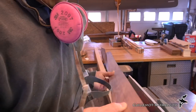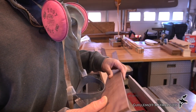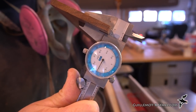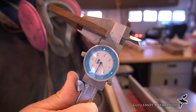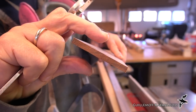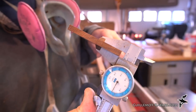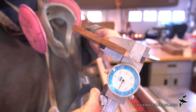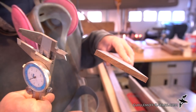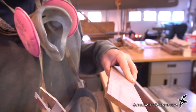When I got these walnut pieces cut down and got rid of all the rough spots and blade burn and so forth, I'm down to a quarter inch thick. For this, I want a 1 and 1/8 thick shaft. When I glue the Sitka on either side, I want 1 and 1/8. So that's 9/8ths and I'm going to take away 2/8ths — so we're going to end up with 7/8ths. I want equal amounts on either side, so that's going to be 7/16ths. So we'll cut something a little bit oversized from 7/16ths in the Sitka spruce to glue on either side.